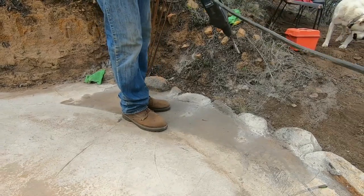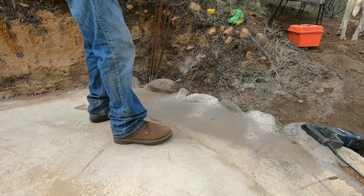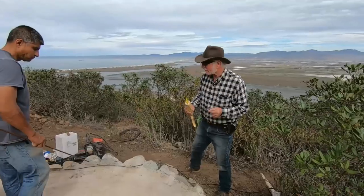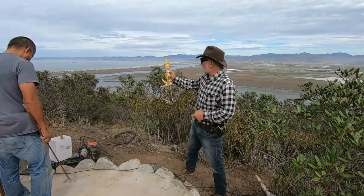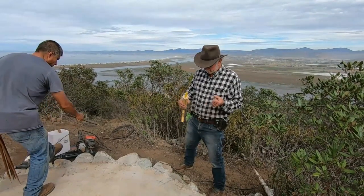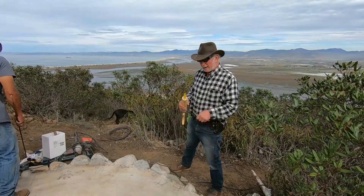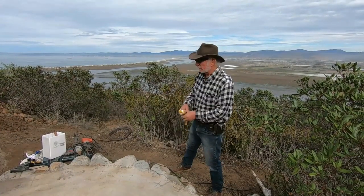After we drill the holes, we have to get the cement really clean. We've been using a little blower, and also cleaning with a rag and then blowing them out. Next step: I cut the tip off of our ultra extreme grab caulking. What you really want to do is find the epoxies — the better ones are very expensive, like $30 a tube, but they have more grab power. We're going to fill the hole and then put our rebar down in the hole.